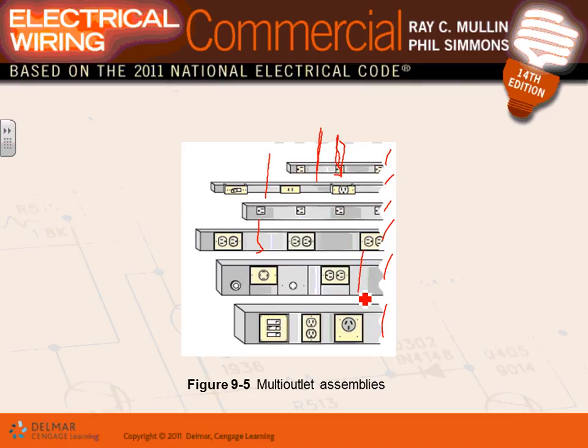Okay, for these, remember, for every 1 foot, you give it 180 volt-amps if it is simultaneously used. For every 5 feet, if non-simultaneously used, you give it 180 volt-amps. You guys remember when you did the calculation with me? We said for multi-outlet assembly you give them 180 volt-amps, and you derate them if they're non-simultaneous.